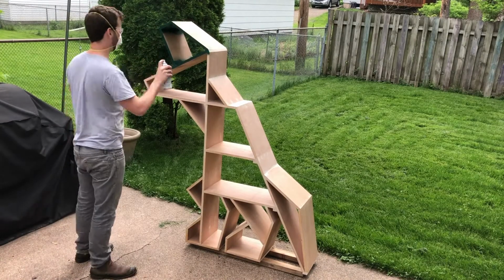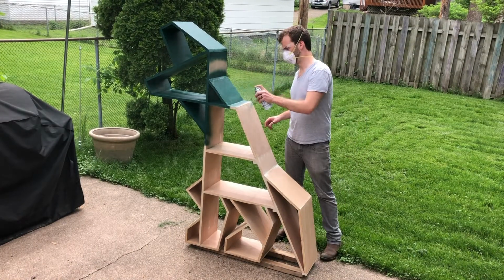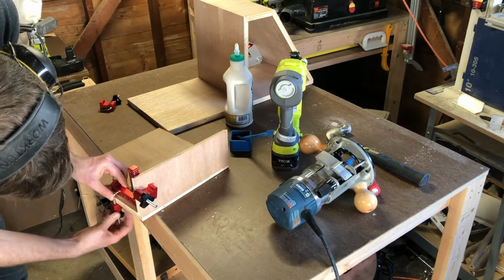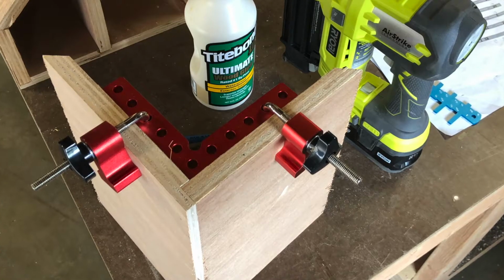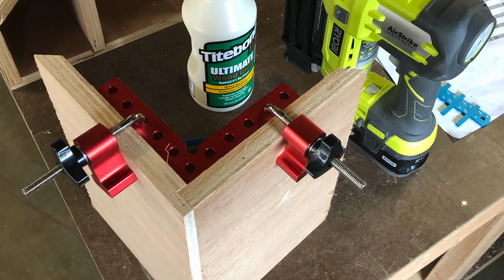Let's check it out. A few months ago, while making my plywood dinosaur bookshelf, I ran into a problem clamping pieces together during glue up because I had so many different angles. For gluing rabbets, dados, and perpendicular butt joints, it's hard to beat the precision of positioning squares because they are machined to a perfect 90-degree angle. I'll leave a link to the positioning squares I use all the time in the description.